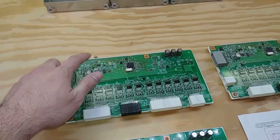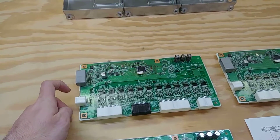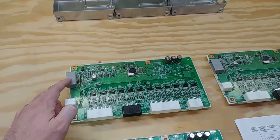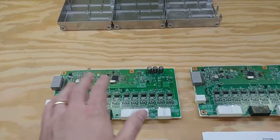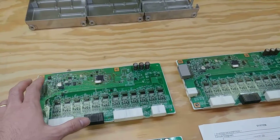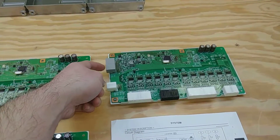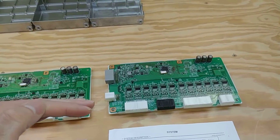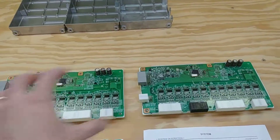All the parts to build Pack Sniffer 2s and populate the rest of the IO on here are still delayed. One IO line will be used as essentially a unit ID, since I have two identical units and want the code to be the same — right now they'd stomp on each other, sending packets at the same CAN addresses. If the unit ID line is left floating it'll use the regular address range; if you ground that IO line in the harness, the other unit will add 0x10 hex to its base CAN message and all its other messages will increment by that same amount.